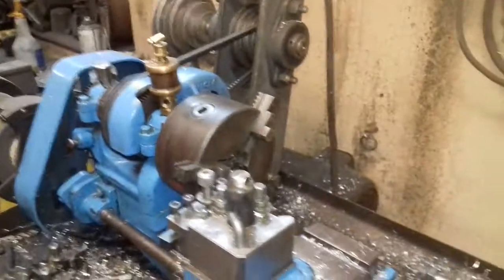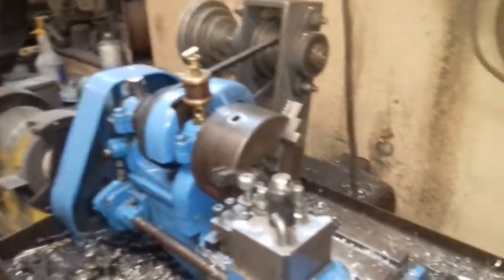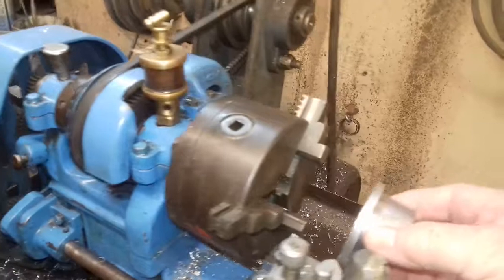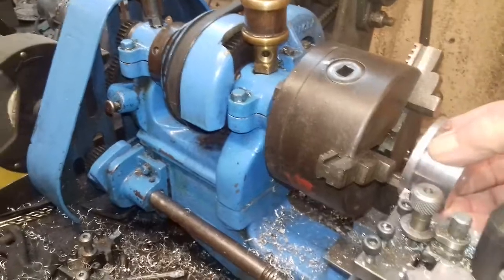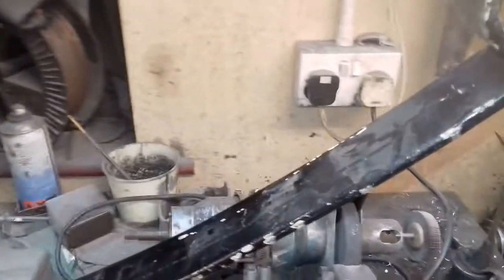I've made four so far but I've run out of aluminium. The problem I had — because I made it out of a bit of two and a half inch bar, it wouldn't actually go in the lathe. So what I had to do is put a bolt through it and do it that way, sticking out like that and machining it down. But it worked out okay. So these are going to go in there.